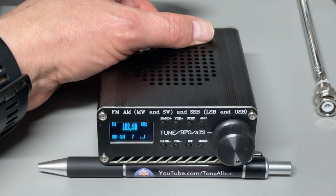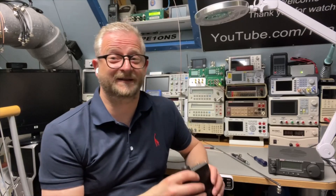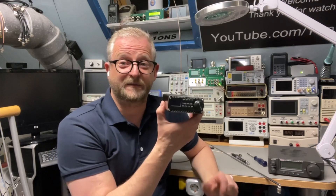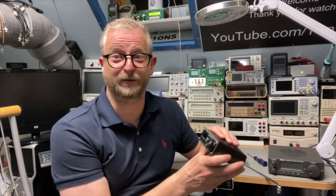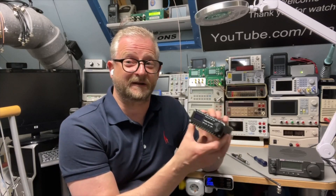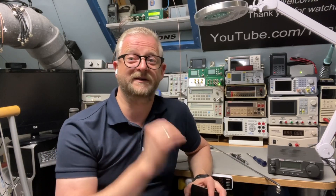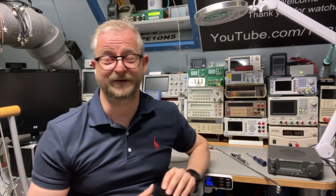Well, that was a pity that the AM band wasn't working, but the FM is working very well. I have another unit coming from Banggood — that one has a white knob, while this one is black. I'll need to start a dispute for this one. I would have liked to show you a lot more, but the band was broken. It was a great opportunity though to show you the upgrade process — how easy it is if you follow the correct steps: install the library, select the right board, and just flash it. We did a successful update. Thank you for watching, and I hope to see you next time.